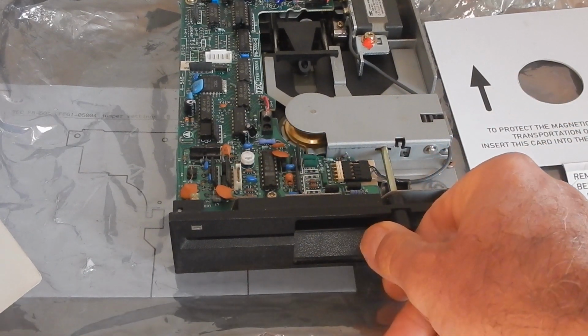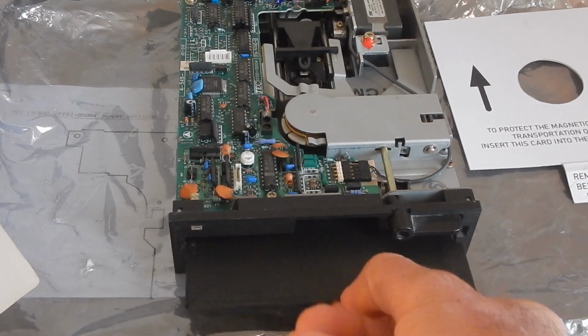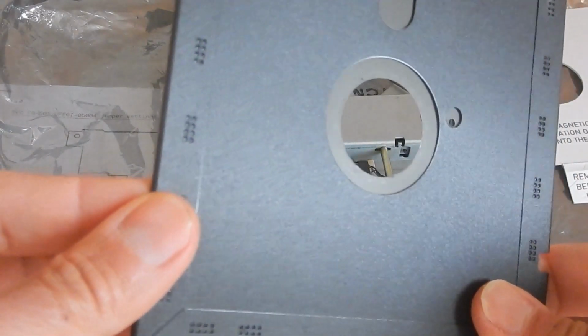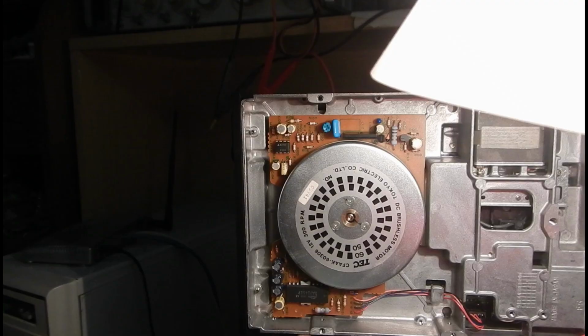We could flip the floppies upside down because Commodore and also Apple drives did not use the index hole at all, and everything worked fine. However, we must make sure that our drive is not using the index sensor pulses for the spindle motor speed regulation. I haven't seen any 48 TPI drive that does that, and I'm sure this one doesn't need the index pulses either. But this is easy to test with the Greaseweazle, so let's do it.